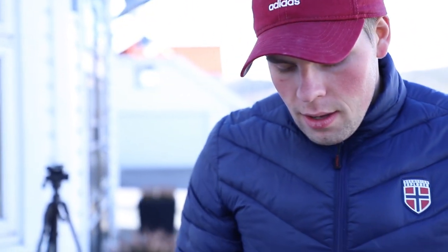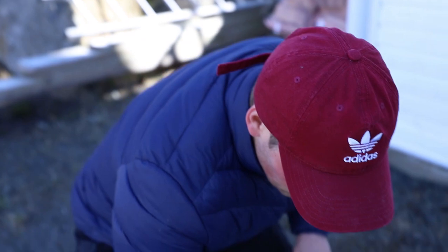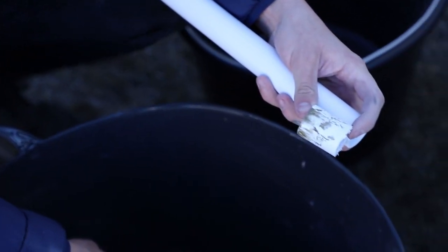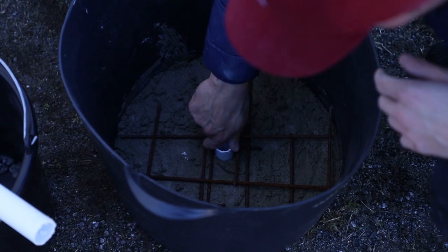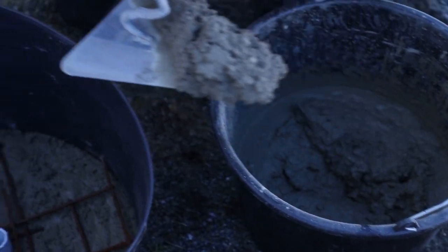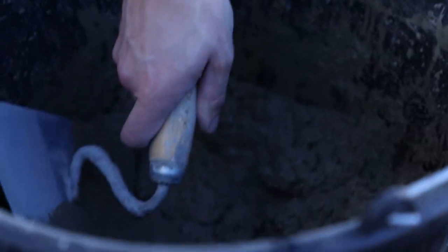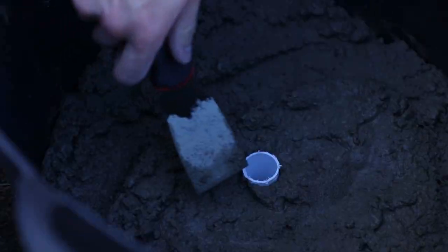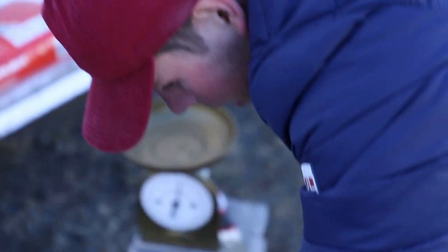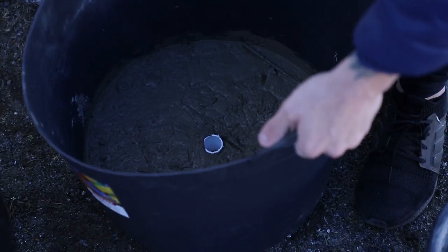I didn't blend enough so we're going to blend a bit more cement and pour it over again. After that we'll weigh it to see how much it weighs. I also see this tube piece has to be a bit thicker, so I'll saw out a new one — but you can see it's dead centered inside the mold, which is absolutely perfect. We've got more cement going in right now. Super important: go like this to get rid of all the air pockets — we don't want those.